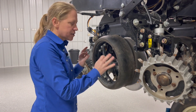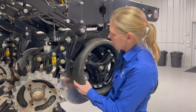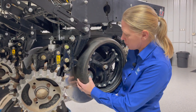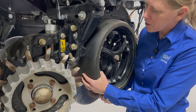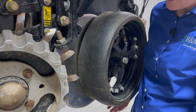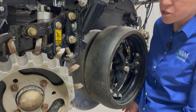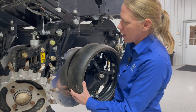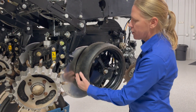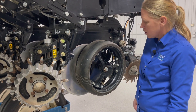Let me show you how I like it when it's set just right. I get it up into that running position, again try to pull out — there's no space there. But notice as I let go, you can actually hear the rubber sliding down the metal, and it's not just slamming down anymore. It's coming down at a much slower, softer pace. That's what I'm after — I want to hear that rubber slide down the metal, not that slamming we had on the other row.